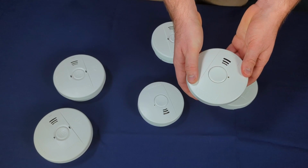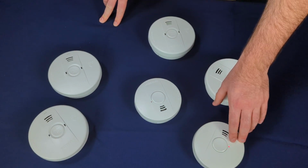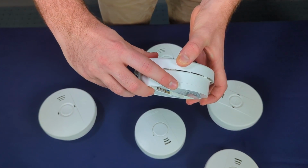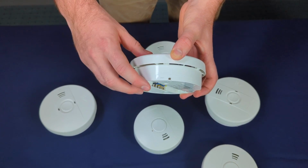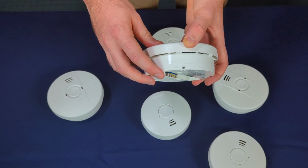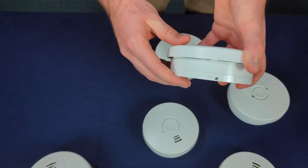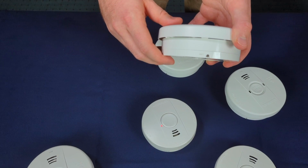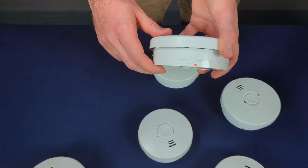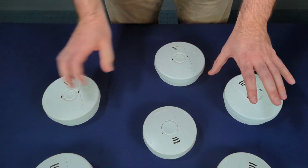Starting with this DCW, we'll double press, turns it on, it's flashing on and off. We get the connection noise and 3 light flashes out of it. Next we'll do a wireless base, LIFWMB2, double press. We get the flash on and off, it means it's looking. Three flashes. We'll do a LIF6000 WB next. Yep, and now we have 3 flashes. And then you continue that process with all the other alarms on the network.